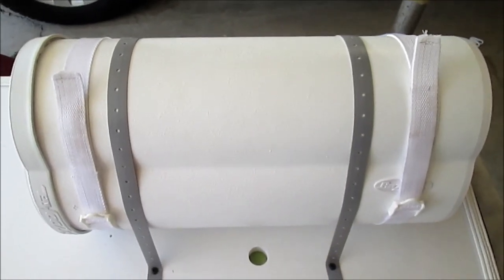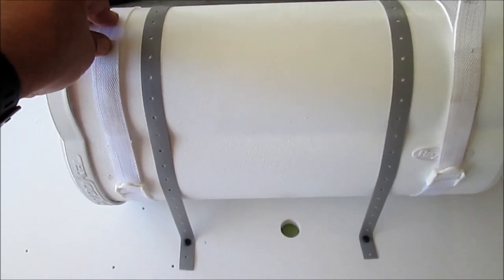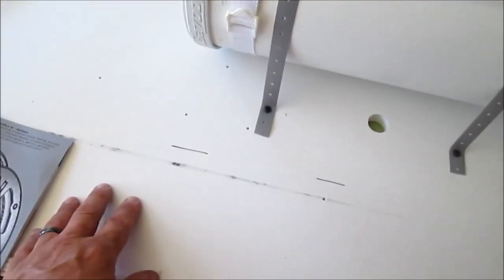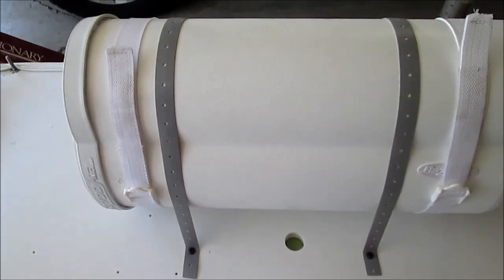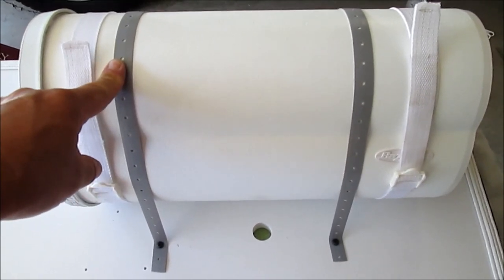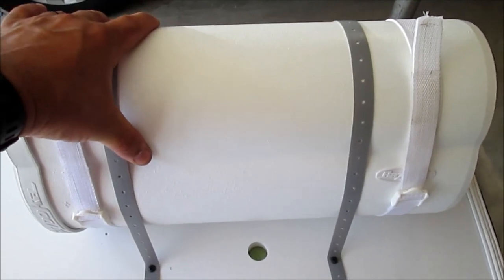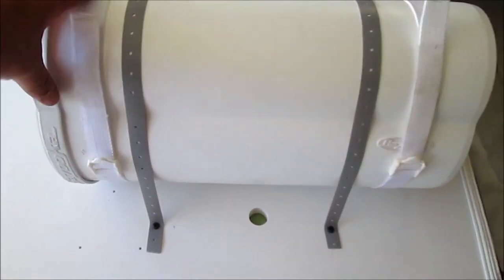This is meant to be installed on the floor of the boat, but I don't want to do that because I have removable carpet and I don't want to drill holes in my floor. I'd like it up out of the way so I can hose down underneath the seat. So I chose to suspend it underneath the passenger seat. I'm using the Bazooka straps that came with it, but also some plastic straps - I'd much rather have stainless, so I'm going to figure something out and change this eventually. For now I think it will work fine, even though right now it is super solid.